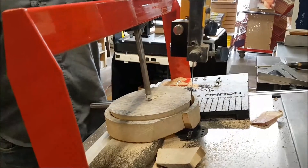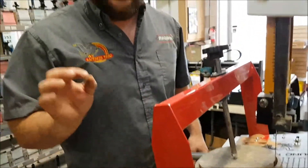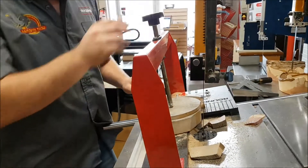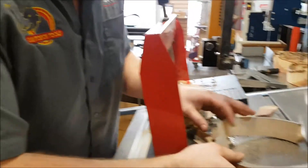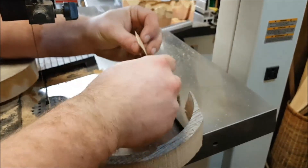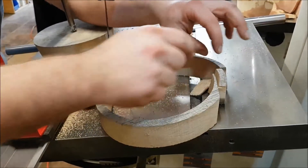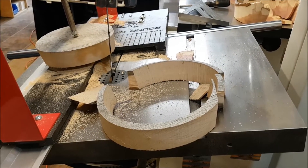So that did not go well, which is exactly what I hoped for. Let's take this out, I want to show you guys what happened here. Let's wait for this blade to slow down just a little bit. If you look at that circle I just cut, it actually cut right down into a spiral. It should have ended right about here but it continued about an inch or two beyond the perfect circle. So it cut a spiral that kept getting smaller and smaller and smaller.